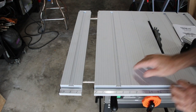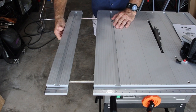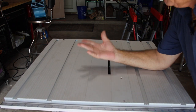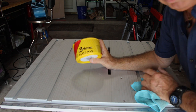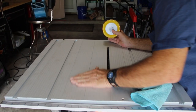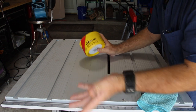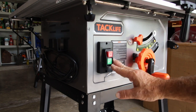On the left side of the saw you can loosen the knobs and pull this out to extend it further to support material. Whether you have cast iron or, in this case, aluminum, always put a little Johnson's paste wax down and wax out the top — sort of like waxing a surfboard. That way wood will slide really nicely through without any hang-ups or friction to mess up your work. This is something I've done on every table saw I've ever owned.